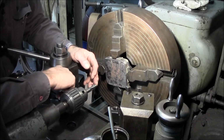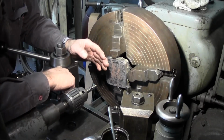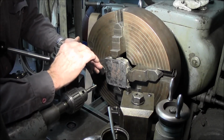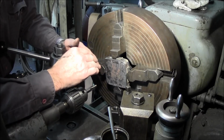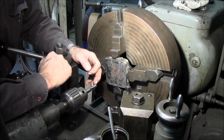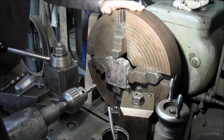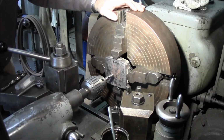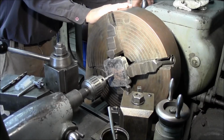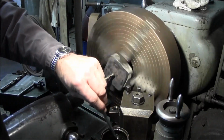and he's stating that it's better to start with a starting drill like this than it is to center drill it and then pop in with a different angled drill bit like your 118s or so after you've hit the 60 degrees, so that you're not making contact in the center of your flute and damaging your drills as much. And you know, so anyway, we're giving it a shot here. And here we go.